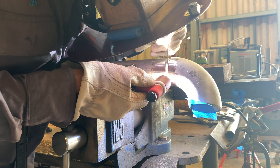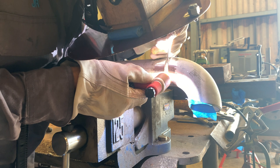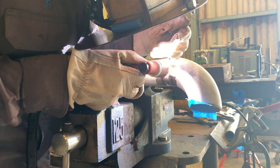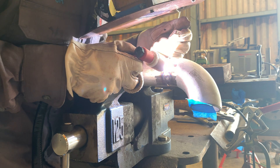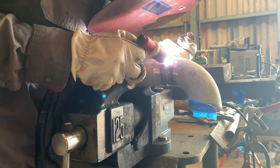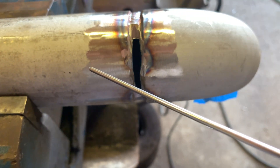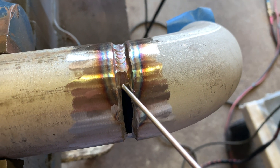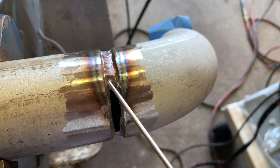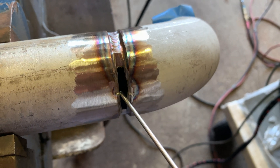Our bead is in there, making it nice. Let's go ahead and finish the weld. Alright guys, we're getting ready to tie in. Make sure you guys give yourselves a little — think of it as a boat ramp. You don't want to just jam it into the marina; you want a little ramp in there. Give yourself a little ramp, a little landing.